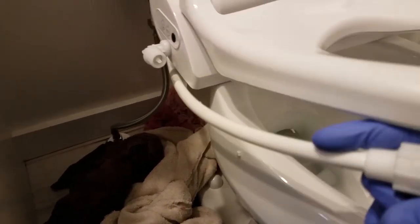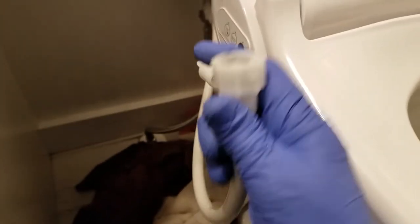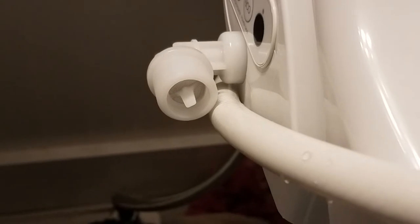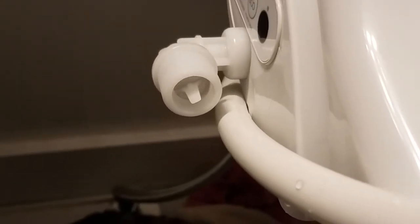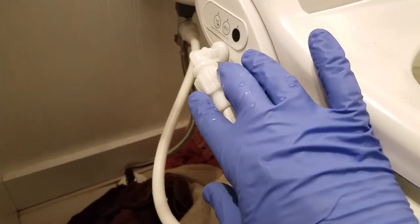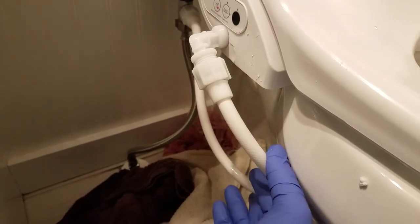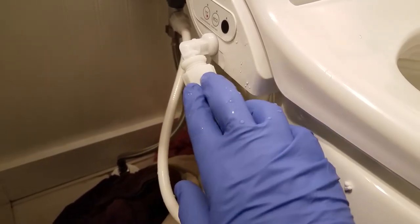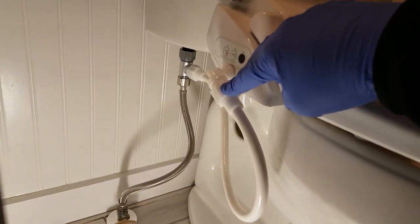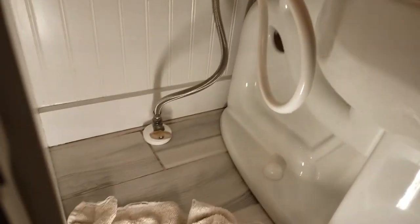One of the final steps is to take our hose and attach it right here. There's also a filter on that little piece that's sticking out — if you pull on that, it'll actually remove the water filter. You want to leave that in place, but if you get a lot of minerals and sand and particles in your water, then you may want to occasionally remove the supply hose, take out that filter, and just flush it out. This hose will tend to want to fly out, but we can control that by loosening the connection and turning the hose in the opposite direction so it comes up against the bowl, then tightening — these are two separate pieces so you can make that adjustment. With our connection tightened, we are ready to turn on the valve.